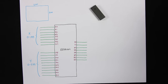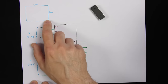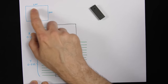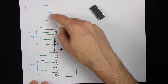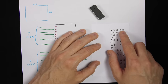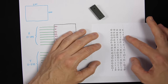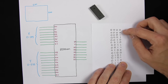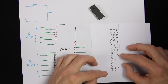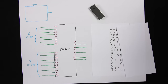There's one issue: because we used a 10 MHz pixel clock instead of 40 MHz, we only have 200 pixels by 600 instead of 800 by 600. That's a weird resolution — pixels would be stretched. It'd be nice to slow the vertical counter down so each line repeats four times as well. If we ignore the bottom two bits of our Y counter, that divides the counter by four, making each value repeat four times.